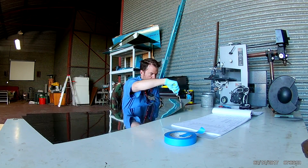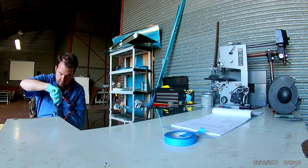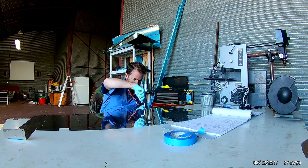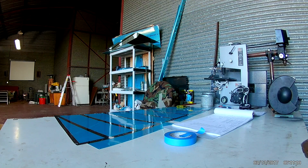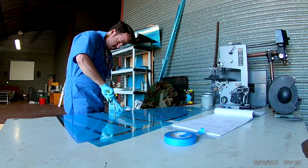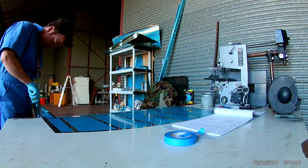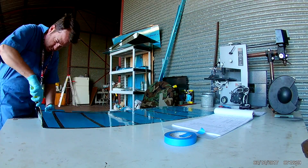This is the deburring of the skins. The skins are very thin — I think it's 16 thousandths. It's very light. You want to keep your rudder weight down; that's as far away from the spinner in the front as you can possibly get. I had always wondered why some planes always had fabric rudders — save weight.